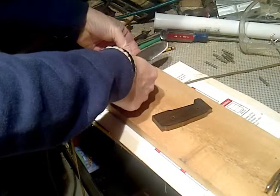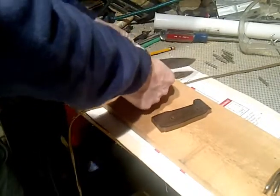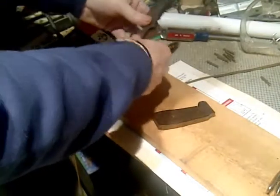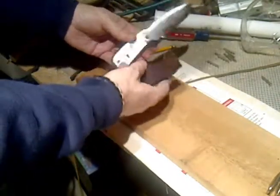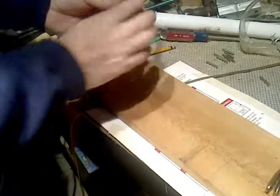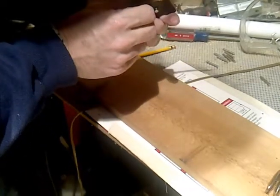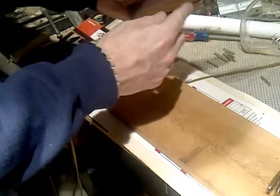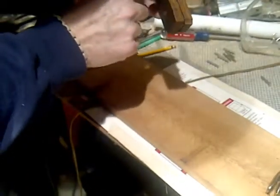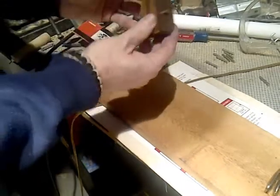This sanity check is to make sure everything's going to look right, and I do want it tight. Even with a drill press, you can tell the angle can be off a little bit. That went in pretty neat — so that's what I've got here. I'm not at the metal in the tang, I've got plenty of overlap, the start of the handle on both scales is about even, and I've got plenty of room at the end of my tang.